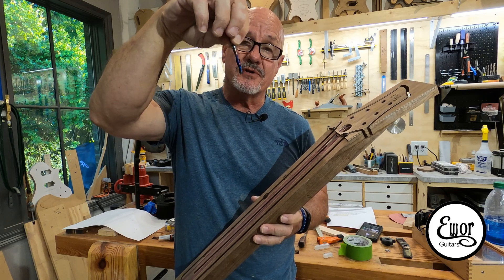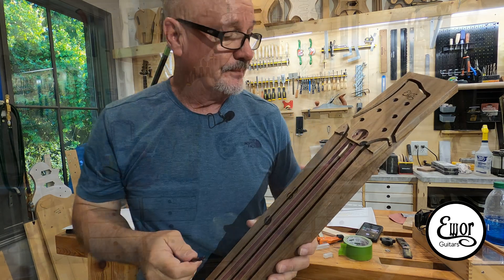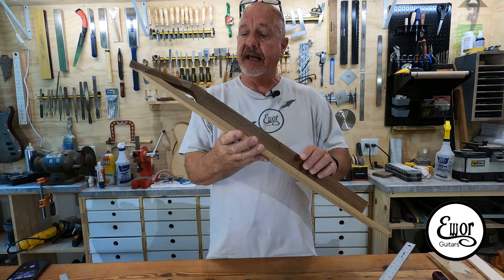Let me give you a quick recap. The neck thickness was about an inch and a half, and in cutting it I didn't take into consideration how much bit was hanging down past the collet. It got down, started the last pass, and the collet was rubbing on top of the neck. I stopped it, thought I could run a surfacing pass to clean it up, so I started it back again — but I wasn't thinking about the headstock plate sticking up higher than the surface, and the collet bore down into those two spots. I'm going to turn it into a feature and keep this guitar as my first CNC-made guitar.